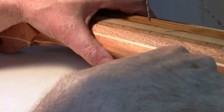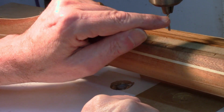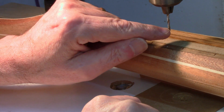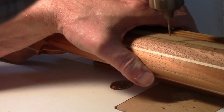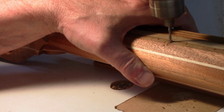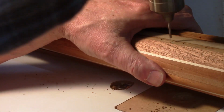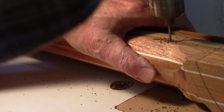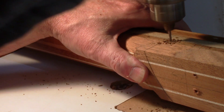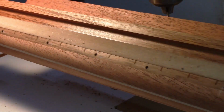Not that these all have to be equally deep, but obviously you don't need to drill down an inch, just maybe 1/8 of an inch. A little hint here with these really thin drill bits is to chuck them so that there's just enough showing to do the job. Otherwise they may wander a bit. So I now got the fret marker holes.